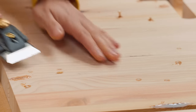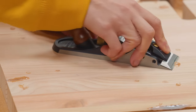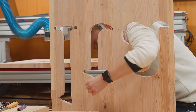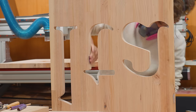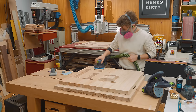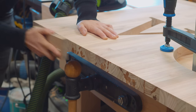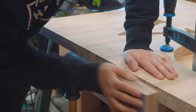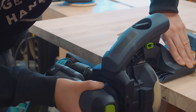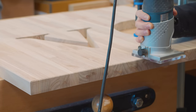And here I found a moment to put my beautiful trimming plane to use. Now it's time to refine all surfaces, from the interior edges of the letters to power sanding the main faces. The end grain took some time to sand smooth with all the CA and epoxy glue filling the cracks. I added a small chamfer around the exterior edges using a palm router.